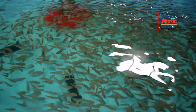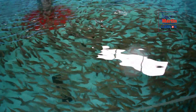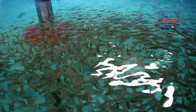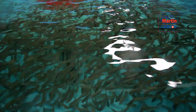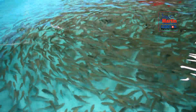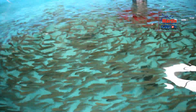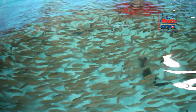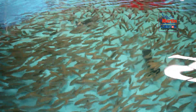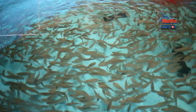The circular shape is also selected for compatibility with another essential component: the EcoTrap. The EcoTrap is a great addition that helps in cleaning wastes from the tank, and it is more efficient in circular tanks due to better waste draining. EcoTrap is a small compartment built right at the bottom of the tank which has two-way filtration — it filters wastewater to the mechanical drum filter, and solid wastes go to the waste collector with a small amount of water.